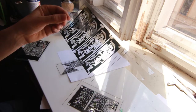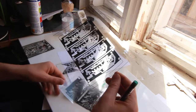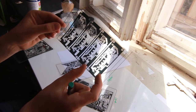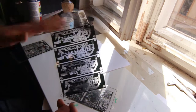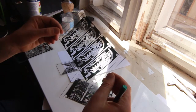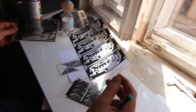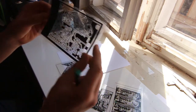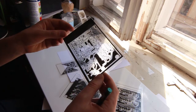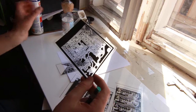Even with the cheap copy shop print, the black is a little translucent — you can see through it slightly. So the idea was to take two sheets and place them one above the other with the same layout. The problem here is aligning them correctly; I'm working with a line width of maybe around 10 mil, which is quite small. If there's a misalignment between the two foils, the PCB will be trashed. The solution is to create a mask consisting of two foils laminated together using spray glue, so you can no longer really see through.